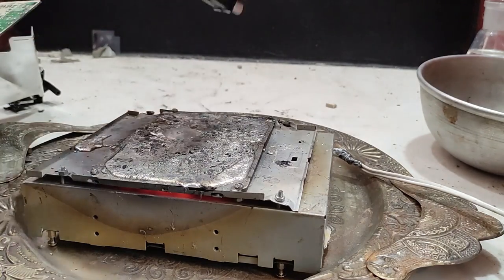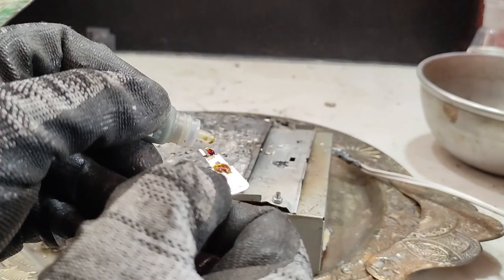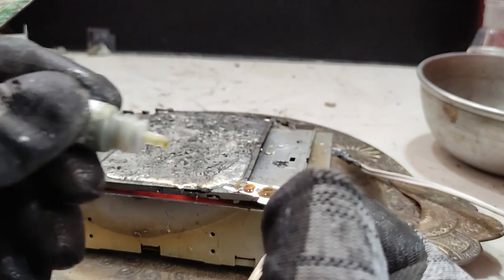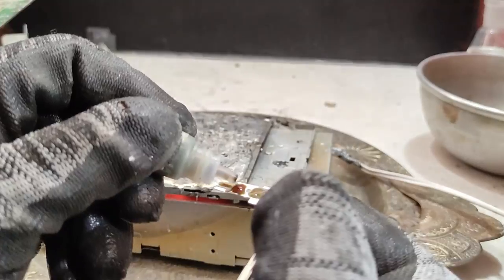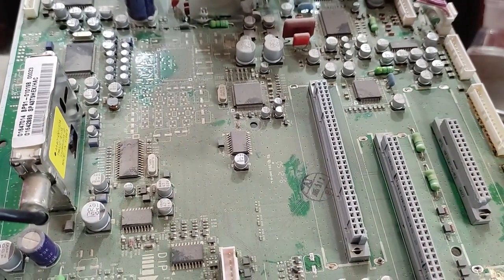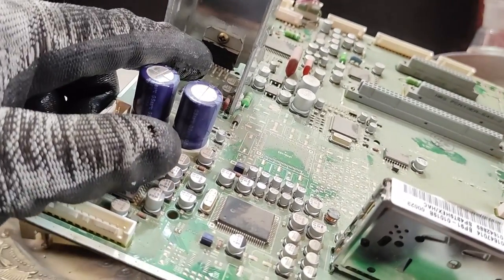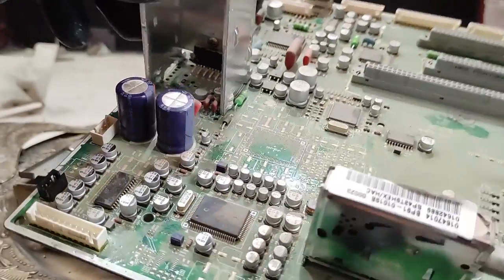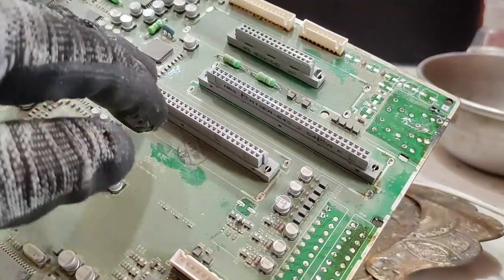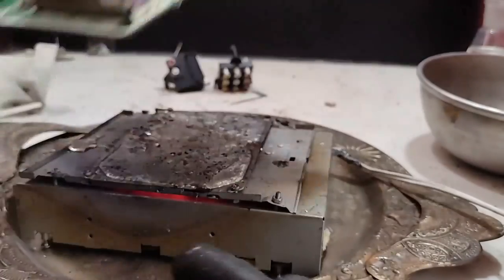Every PCB has been removed from the main board. I did the same for the pins and afterwards checked for gold plating on the AV pins, then carried out silver testing with Schwerter solution — both were negative. There isn't any gold or silver on the rear socket of this TV. I found 11 IC chips only on the main board itself. These quad IC chips usually yield one to four grams of gold per kilogram. There were also some transistor-like components with many legs, and some good-quality gold-plated pins in the plastic ports on the PCB, and a couple of tan-colored MLCCs.